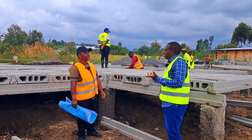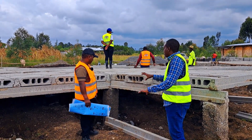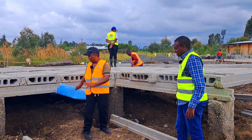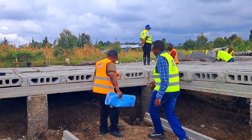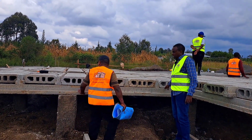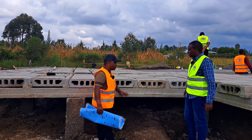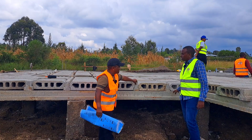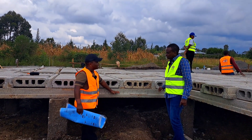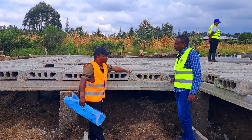To get a proper illustration of the ground beam — this T-beam here acts as the ground beam, and it goes all round supported by columns. We have columns there, column here, and this is the ground beam. Then we have other T-beams on top with blocks — those are the slab T-beams. This is the ground layout T-beam that helps carry the top beams and the slab.